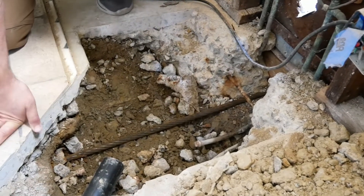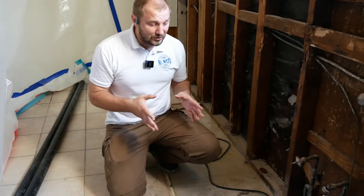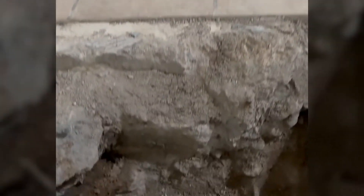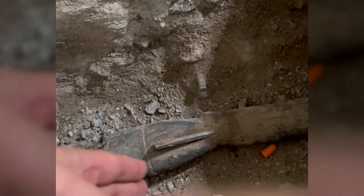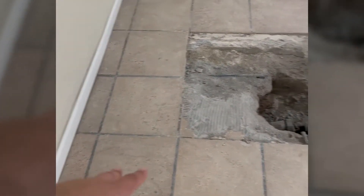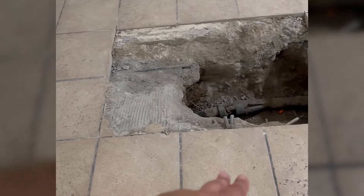There's super strange pressure and it doesn't go. We were supposed to be finished at 2 p.m. — pipe burst the whole house and make connections — but we're working till 5 p.m. and we're not even finished with the kitchen. What we have to do now is dig, find the problem, release the pipe, and finally finish the pipe bursting. They dug a tunnel almost four feet down and got almost to where the pipe is. They saw rebar on top. Here is the footing — there's a rebar, and we're stuck on that rebar.